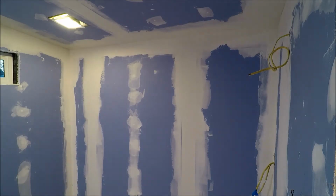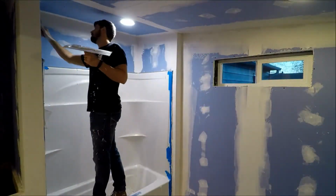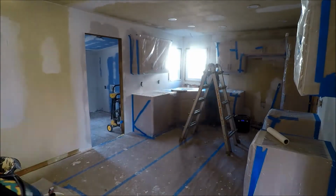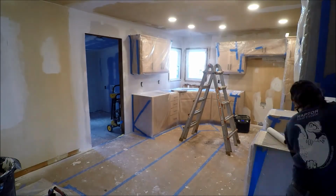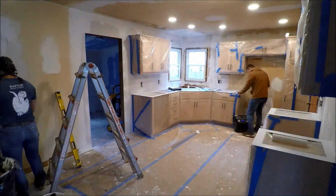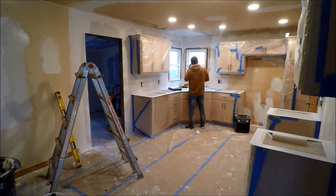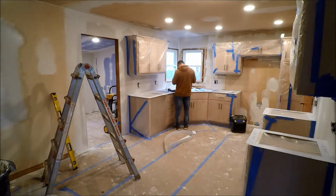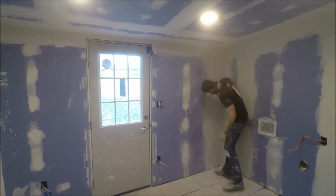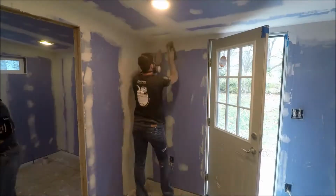And usually there's one piece of drywall that is a little bit lower, and you actually want to spread your mud farther along that. And that's what helps make your tape disappear. Especially because when you get drywall sheets, the edges of them are all indented, so your tape will sit down into the drywall when you mud it. It makes life a lot easier. So if you're mudding all new drywall, it's awesome.